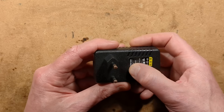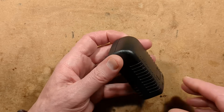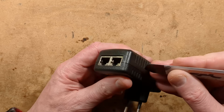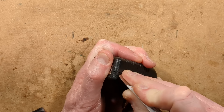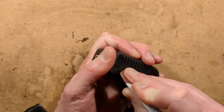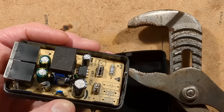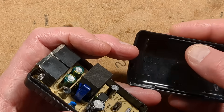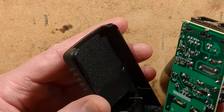Let's get the spudger into this — I don't see any screws. It claims to be rated 48 volts at half an amp, which would be 24 watts. I'm more interested in seeing what the electrical separation is like. It doesn't look like it's going to come apart very easily. I've used the force — it was clipped together very tightly with no glue, but it has little retaining lips. There's a foam pad primarily intended to hold the circuit board in place.